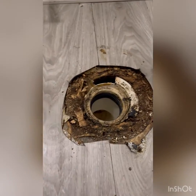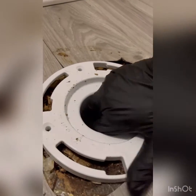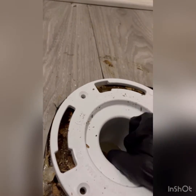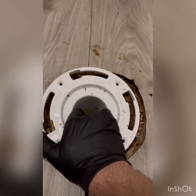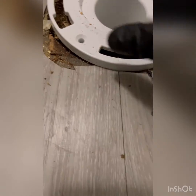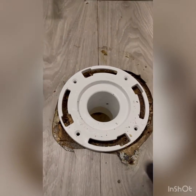Alright, I'm going to set this down — I need both my hands. Got it. Now we just tighten it up. I want these sitting parallel to the wall there. That's flush there. That seal seals where that is down in there. Put some screws in here, clean this up, and we'll be ready to set the wax and set the toilet.